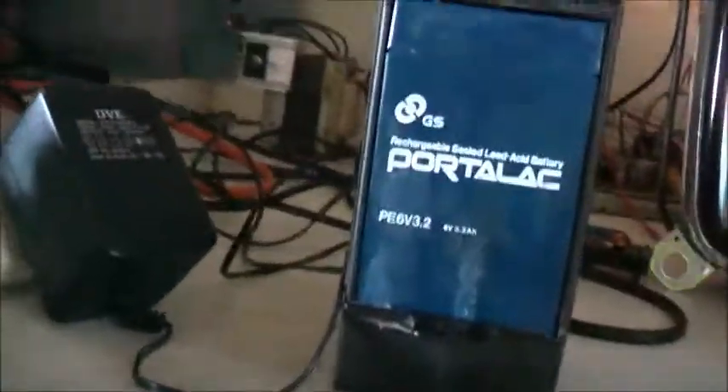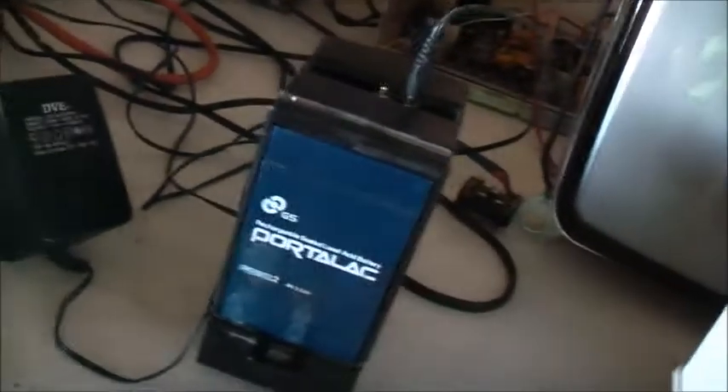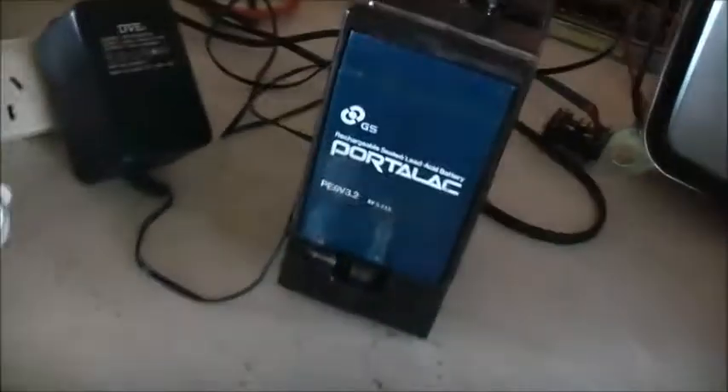Amazingly, despite the sulfation, I've got one battery pack revived. I got it sitting up just to catch any excess acid - it might have accidentally been overfilled. This thing's been on the charger all night and it's settled down now. So 24 volts got into an 18 volt battery pack. Because they've been drained completely flat, they've swollen and sulfated the plates, so I'm charging them. Hopefully the positive plate's good and the other plate's getting stripped of sulfur.